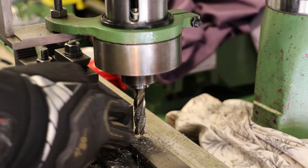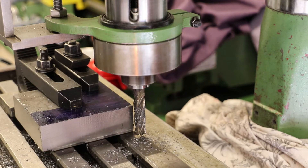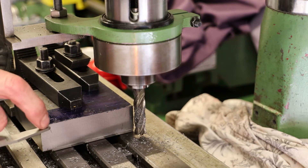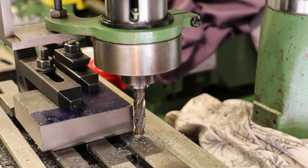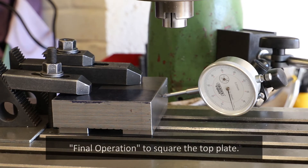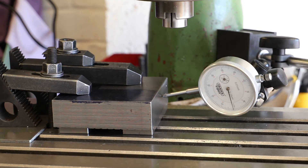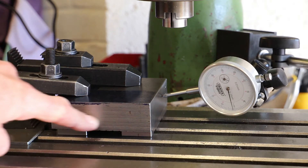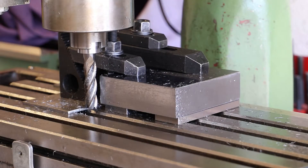The cut hasn't quite put a finished face on all of that surface, but let's have a measure and see where we are. That comes out at 99.72 millimeters — bit of a pain. So I'm going to take off the 0.72 and make it a clean 99 across those two faces. The final operation on the top plate will be to machine off the fourth face, clamping it to the table in the mill — unfortunately I need to take off around about three millimeters off this face, so there'll be quite a few cuts.